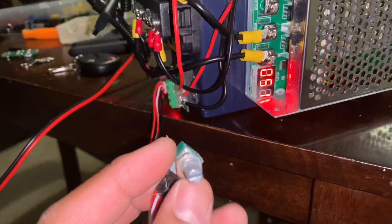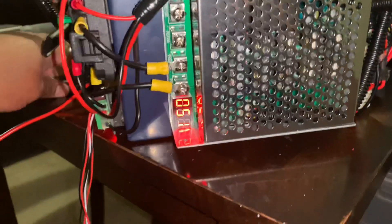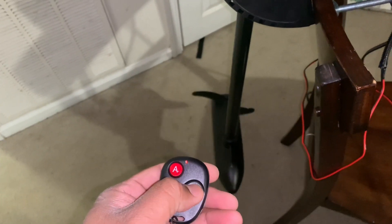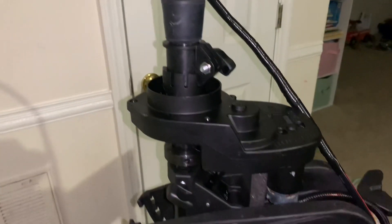I've got a voltage regulator here because I only need three volts — if I put 12 volts on it, it's going to turn too fast. It's working great with two separate two-channel relays instead of one single four-channel, because now my steering toggles momentarily, and that's exactly how I wanted it to work.